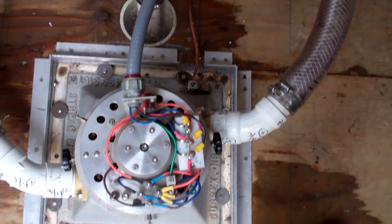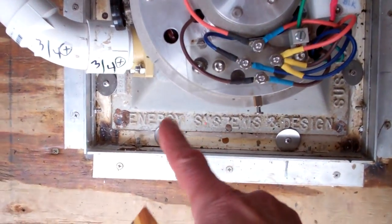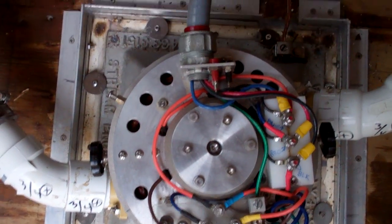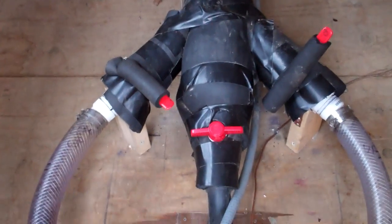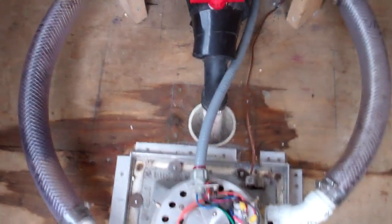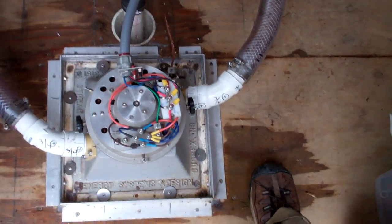This is sitting on a 12-inch by 12-inch by 12-inch plastic box. When it spins the turbine, water drops into this box. You can see right here the two 4-inch pipes going back into the creek — the discharge. And I have a bypass valve that goes into a 4-inch elbow back into the box. If I ever needed to shut the valves off to the nozzles when it was freezing out, that would give me freeze protection — but I haven't had to do any of that. No maintenance or problems with this system.